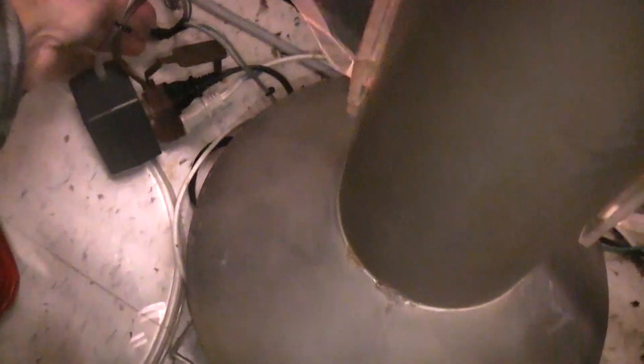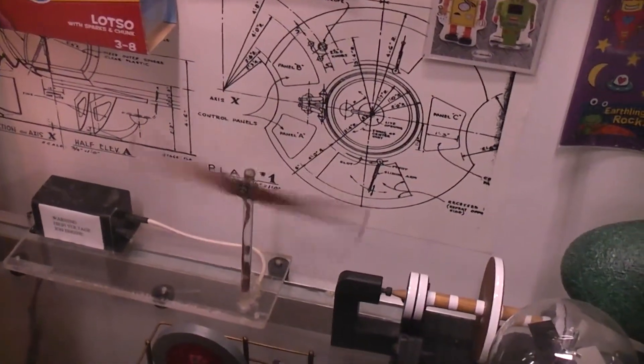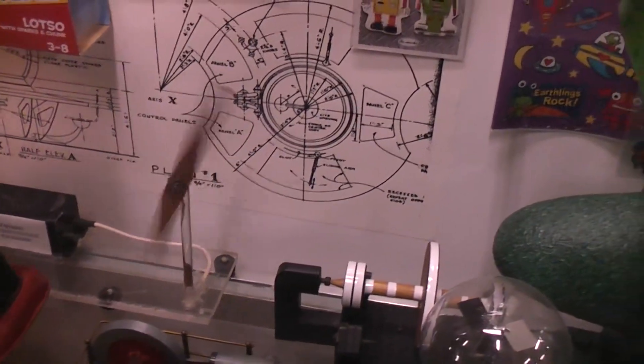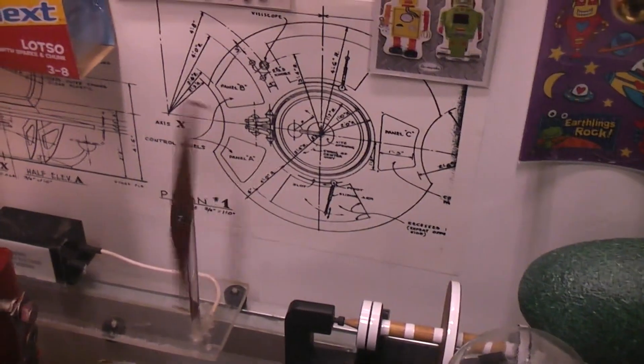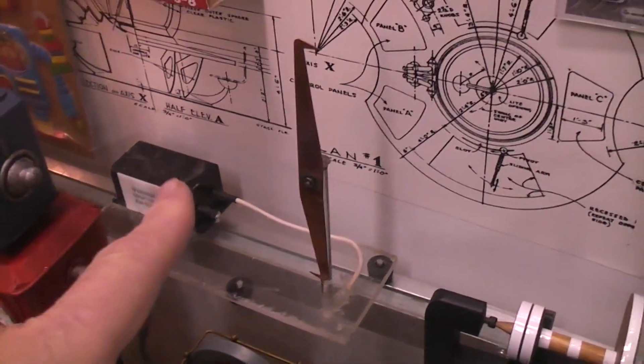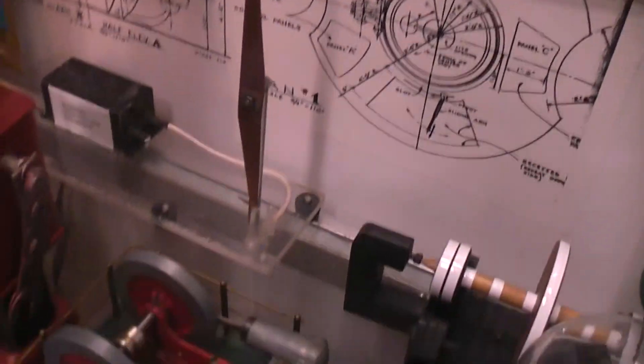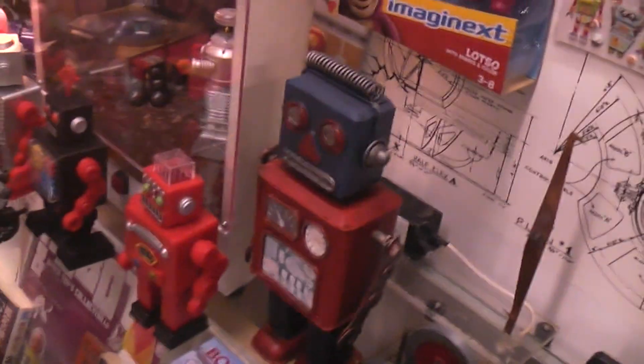Let's shut it down. It's got its own little switch down here in the wall wart. There we go. As you can see, it's slowing down to a stop by turning off the high voltage. That white wire coming from the high voltage supply just goes up and energizes this whole copper assembly. The ions fly out of the little points.